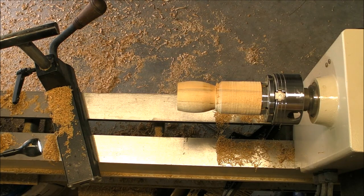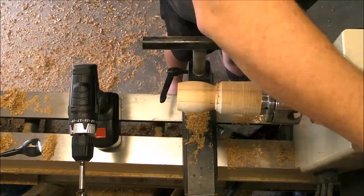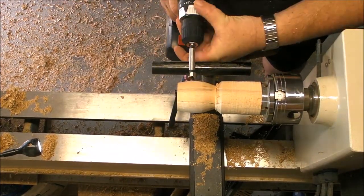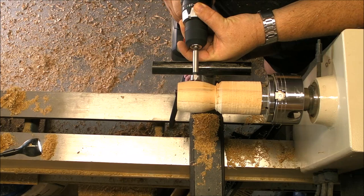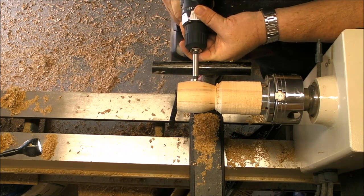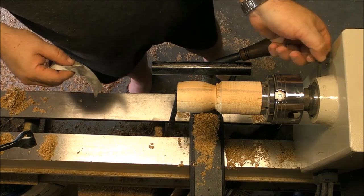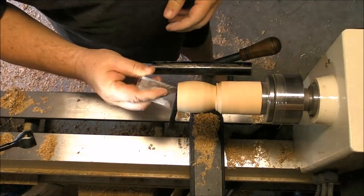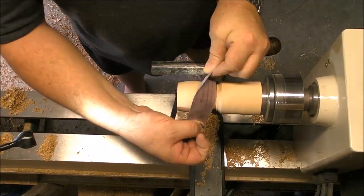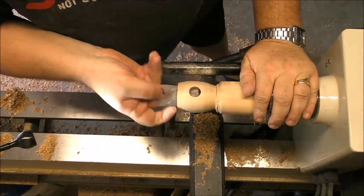The cherry was very beautiful. Now what we're gonna do is make the hole as the entrance of the house. For that it's a good idea to block the headstock if you have the chance, and I use a five-eighths Forstner bit to do that. After that we have to sand inside again for any possible tear-out from the hole, and clean things up.